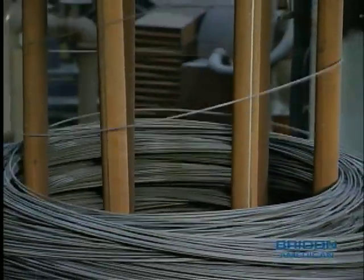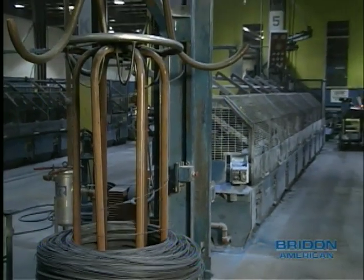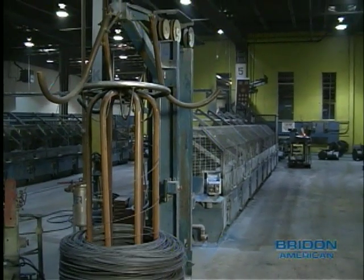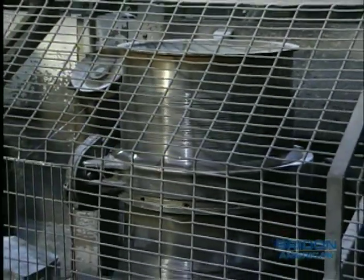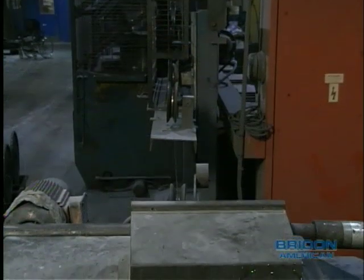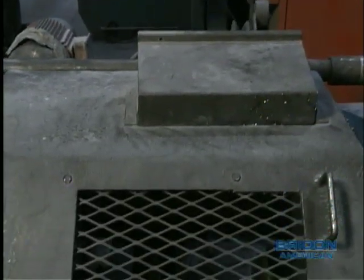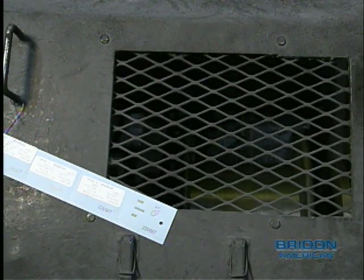In the final wire drawing process, the patented wire would typically begin with a tensile strength of approximately 175,000 PSI. Through the cold drawing process, a reduction of up to 90% is achieved through a series of 9 to 13 dies, giving the finished product a tensile strength from 290,000 to 350,000 PSI. To comply with identification and traceability requirements, a label will be attached to the bobbin to uniquely identify the product.